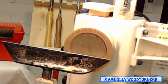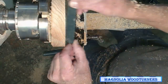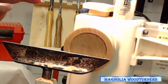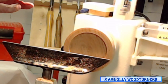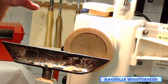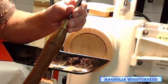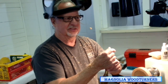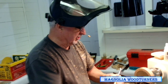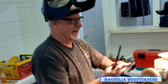I built myself a go-no-go gauge years ago — it's actually kind of snug but that's okay. If you make the opening the same size as the glass, when the wood shrinks and expands during the seasons it can break your mirror or break the wood. Rather than making it larger and having a big gap, I take my spindle roughing gouge — I sharpen mine with the Wolverine jig just like bowl gouges, that's why they all have wings — and I undercut it. I use tapered glass, and if I undercut it, the wood can shrink and move around the glass.